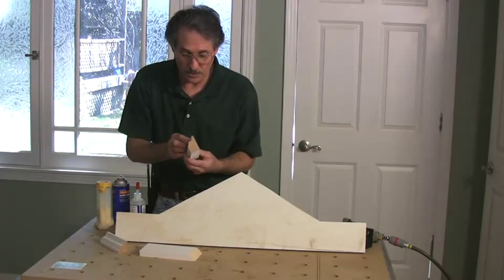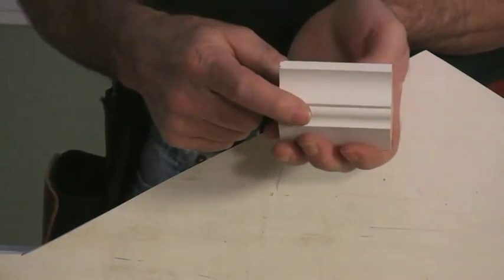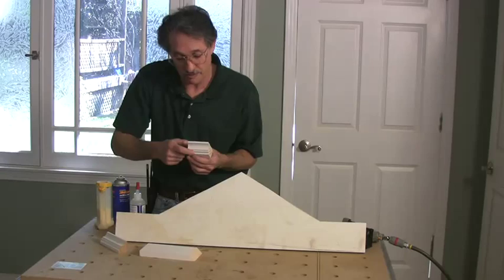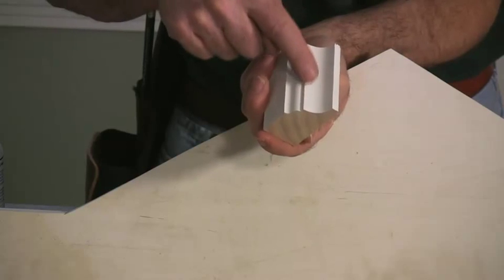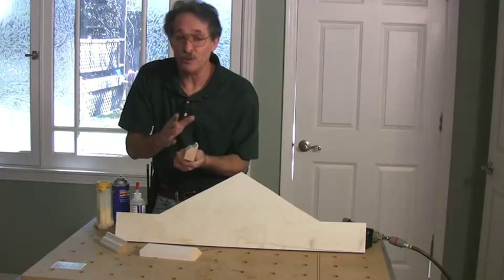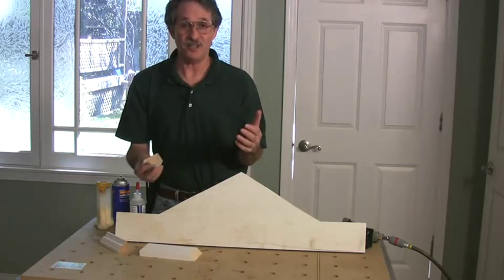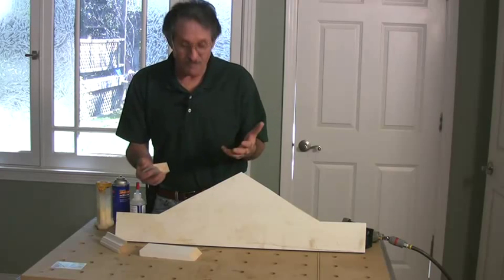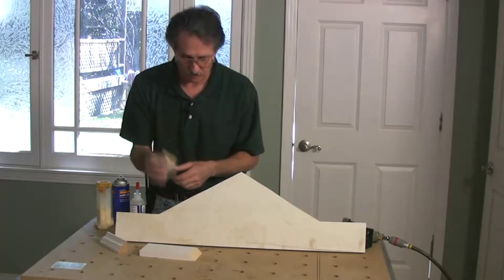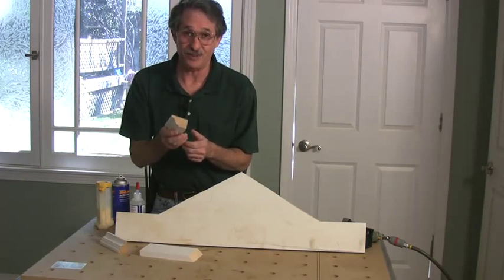It's a really nice molding — I don't know anyone else that makes a molding like this. All the fillets are cut really sharp, and you can see this OG from almost any direction in a room, so it's a really beautiful profile. The curve on the OG is not based on a radius — it's based on an ellipse, which makes it a real Greek molding. We're doing a Greek Revival head, so we want to use an elliptical molding to emphasize that look. I actually had a knife made for this molding for my Woodmaster so I could run it in stain grade when needed.